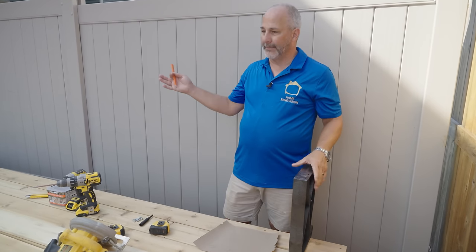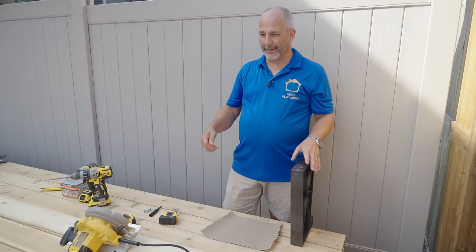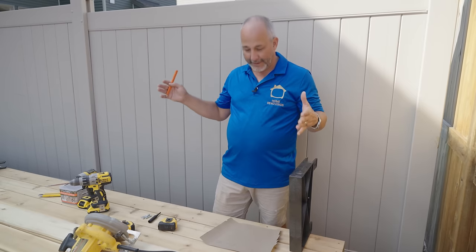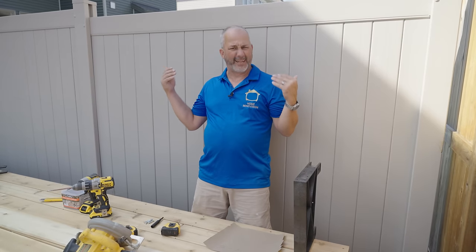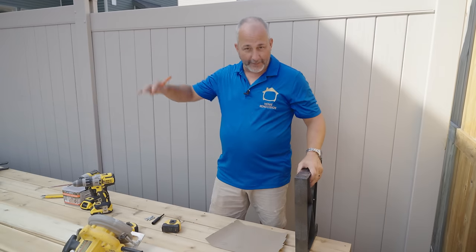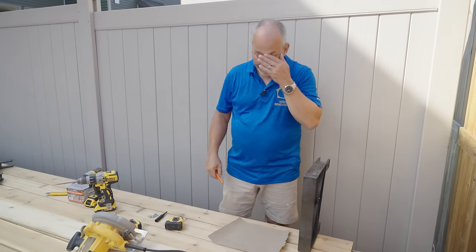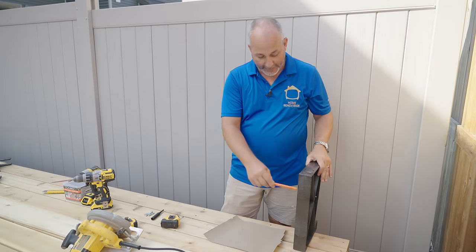Now, all of my lumber comes 48 inches, and that's nice. So what we're going to do is just build 48, because the cushions for the back are actually a different dimension, and they actually finish up right at 8 feet. So the base only goes 46 inches, but the tops go to 96 inches. So that only goes 92. So it's a bit of a weird oddity. We're going to build in an armrest on the right side to adjust for that so that all the cushions fit perfectly. But the idea here is we're going 18 inches. This is only 10, we've got to add 8 inches.